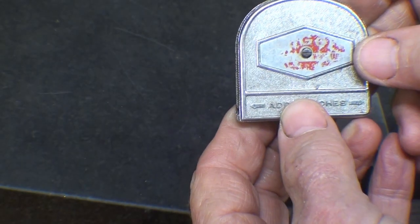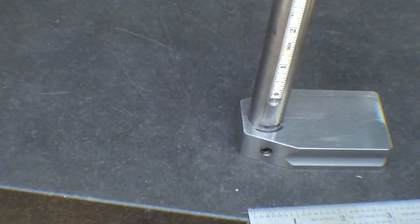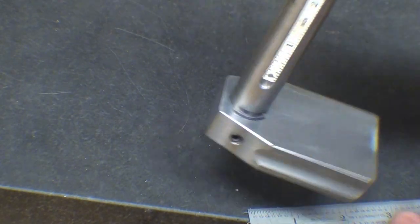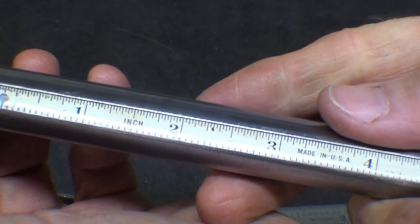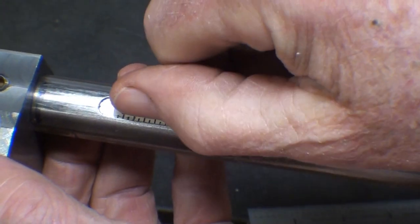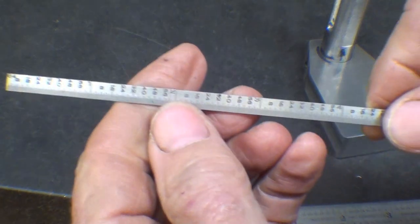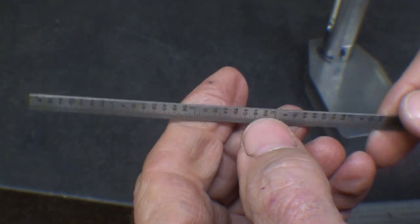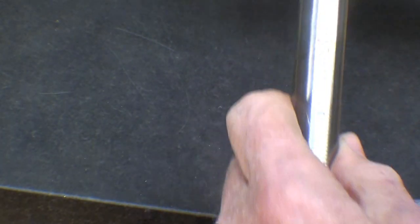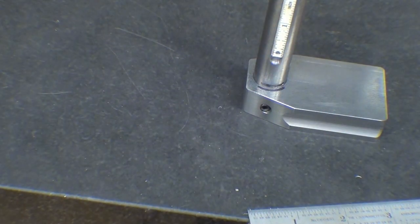Well, actually, I'm already a step ahead of myself, and this has become the donor, and what you will hear is it hitting the trash can now. I have installed it in the quarter inch slot. And the neat thing is that it was a press fit. I took a popsicle stick and forced it in there, and it's just fine. With these other rules, and I may go back to them, if I do change my mind, I would probably have to epoxy them in because they were not such a good fit. And tape rules are somewhat curved, so it fit in there just great.